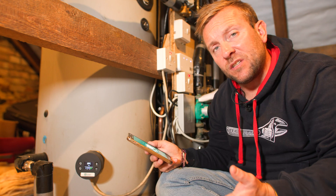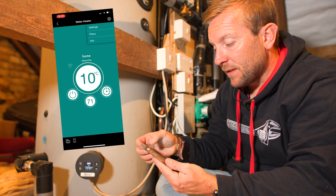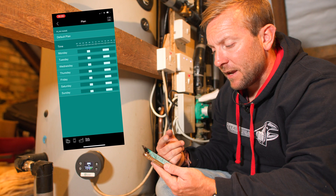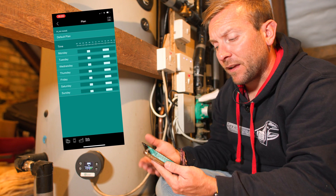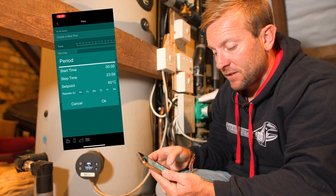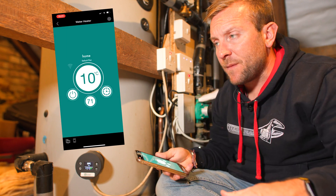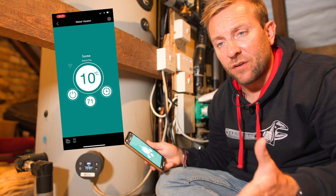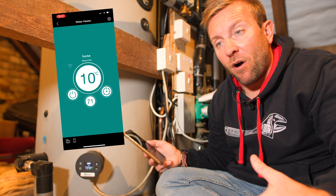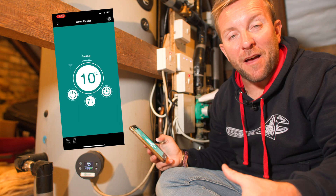I'm not using it on an Economy 7 or Economy 10 system, but you can do that. If we just go over and have a look at the timer, we can go into that, click on the cog at the top, press plans, and then we've got a default plan — coming on at six, going off at eight, coming on at four in the afternoon, then going off at eight in the evening, pretty much for every day. It's really simple to create a new plan. That in and of itself is going to be absolutely brilliant for anyone who uses Economy 7 or Economy 10. But also places like village halls, places that aren't 100% occupied all the time, where you might have a booking system — you'll be able to use one of these really well to make sure there's hot water ready for whoever may have booked it at that time.